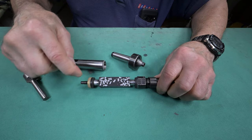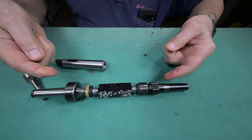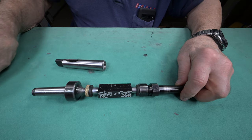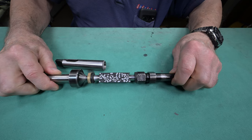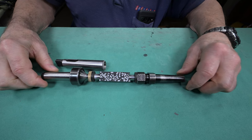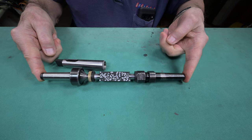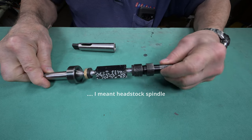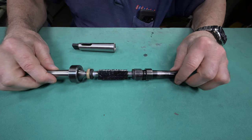Yeah, I know I don't need the nut. I know that normally this can go on here and just the force of the headstock and the tailstock pushing together will work that way too, but please do not give me one of those comments. I've done hundreds of these things. I kind of know what works best by now, and I also know what doesn't work. Normally you would take this assembly and put it into the chuck — this end into the headstock, this end into the tailstock — and just sort of squeeze it together, not real hard but hard enough.